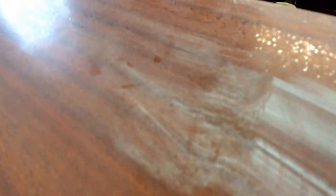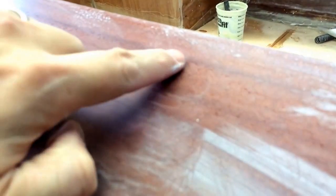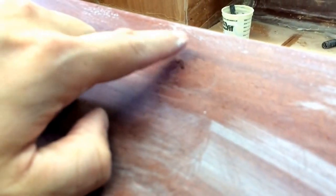You can see that in the middle section here — ignore that shininess for a moment — in the middle section this is very, very smooth. It's uniform; there are a couple of tiny little ripples in there, but for the most part it's pretty smooth and the scratch pattern is uniform, and that's what I'm trying to achieve. Over here in this area, you can see there's a whole bunch of dimpling going on because it's just not faired yet — I have to keep going on that.